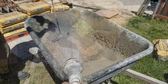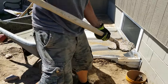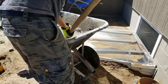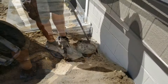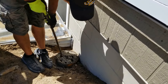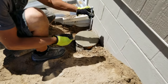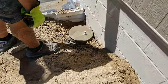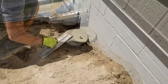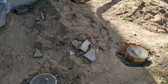Now that the cages are in place it's time to mix up some concrete. I'll be using Quikrete High Strength Just Add Water Mix, mixing it to a consistency where I can easily pour it into the tubes. As I fill the tubes I make sure to pack them tightly to ensure the concrete fills the entire tube, while keeping the cages centered. Now it's time to add some J-bolt anchors into the fresh concrete — these will be used to secure some steel H-beams to the top of these piers. After setting all the anchors in place, it's time to wait approximately 24 hours to allow the concrete to dry.